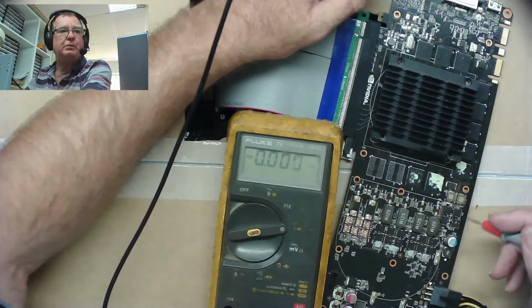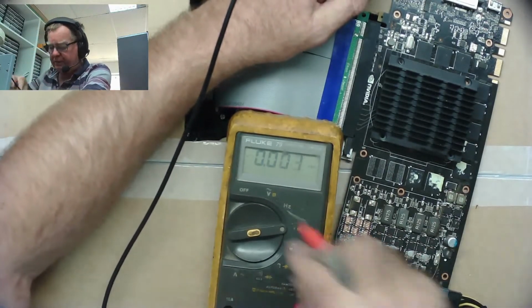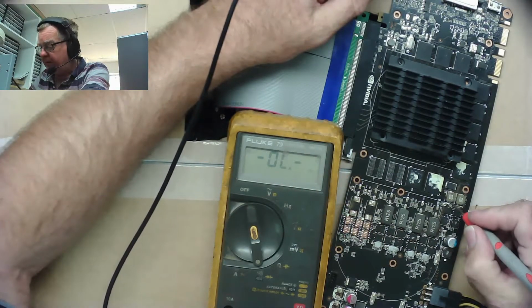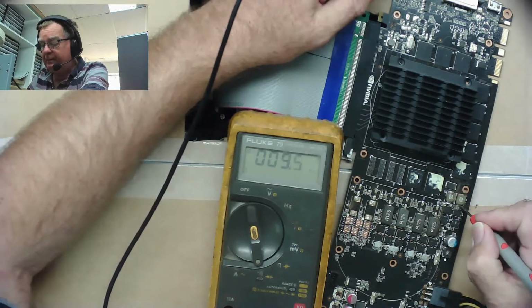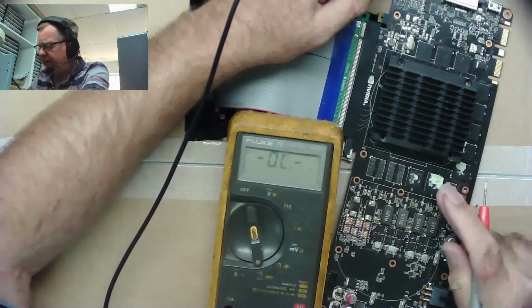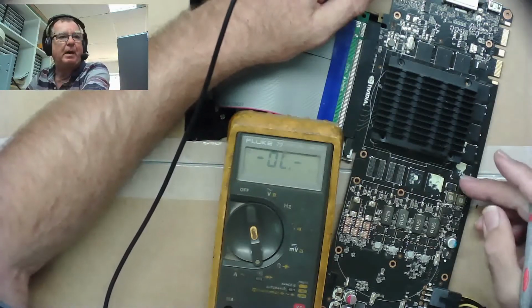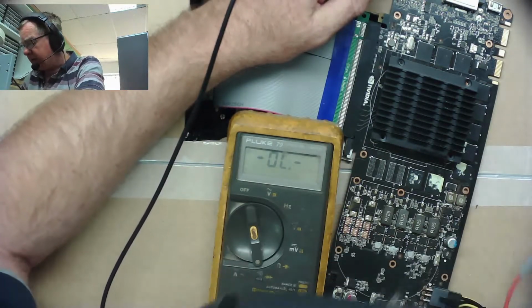The other thing with this one, I noticed before as well, is the resistance of it is fairly low. This should all be off by now. 9.510 ohms. And if that's a RAM supply, looking at other boards, I'm expecting that to be about 100 ohms. And I don't see anything of that sort of voltage.